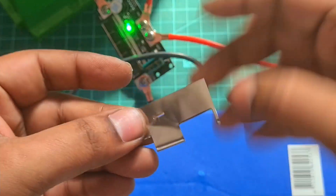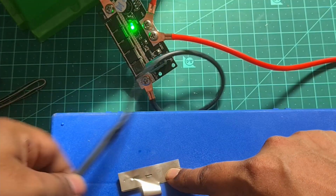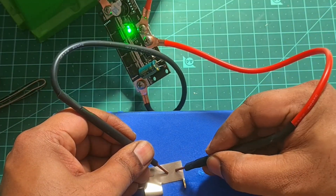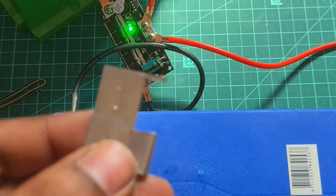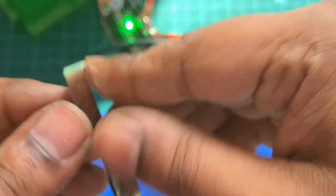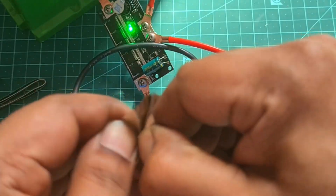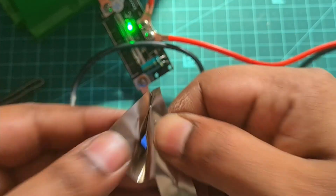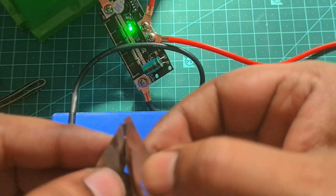Let's try level two. You just hold the button so it goes to level two — as soon as you hold it, it flashes twice, which means the spot weld is completed. At level two, one spot weld came out easily but the other holds up quite well. Level two is okay, but let's try level three.